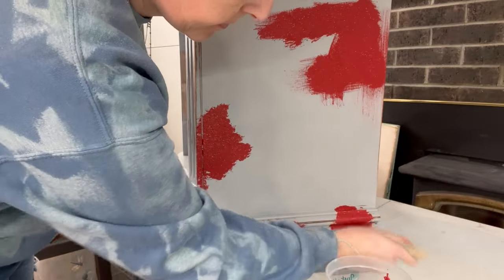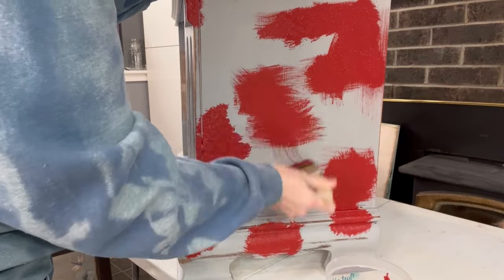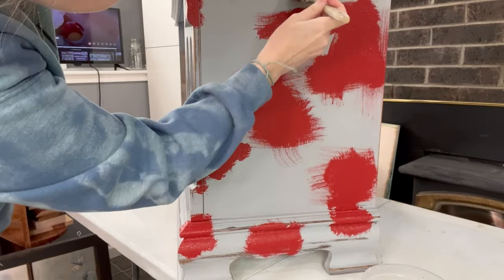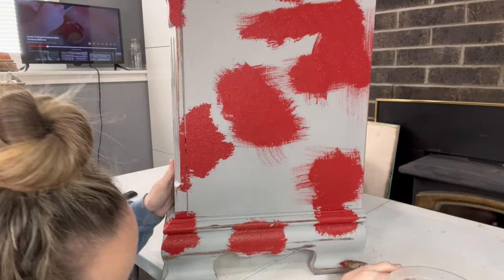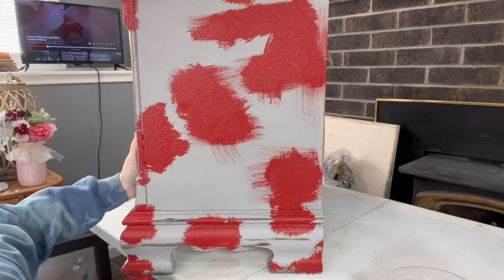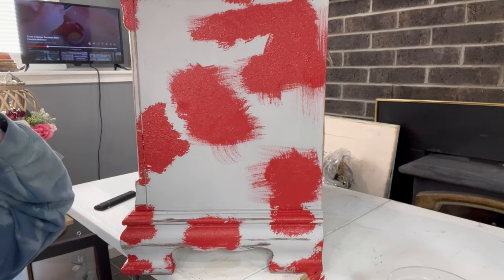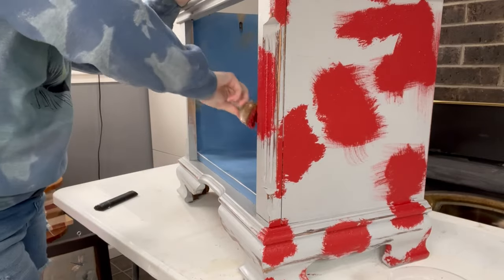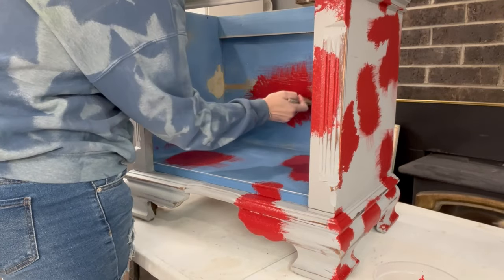You are just going to grab a basic chip brush — my usual chip brushes. She goes in with different stroke areas: she stipples and does brush strokes to get all different levels of texture. I will personally say, after doing this, I liked the look more of the stippling. The stippling created peaks and ridges, and obviously those brush strokes, when I sanded the piece down, it brought out all those brush strokes. So you kind of just have to try it out and figure out your style.